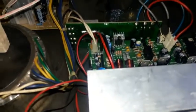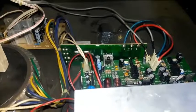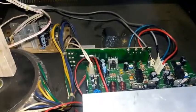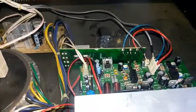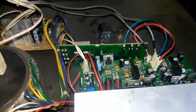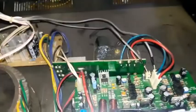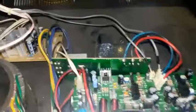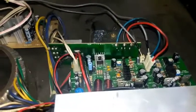Nice. I really like those results, and the heat confirmed that there is no heat factor or any distortion or any excessive heating in the element or any of the input transistor or any of the driver transistor. So I'm really going to declare that this amplifier is fixed. The only thing I'm going to do is, as I said, going to put a 3mm washer in those two sides and tighten those screws in and assemble it.